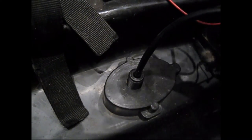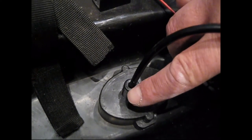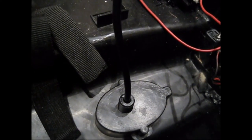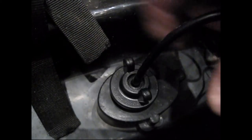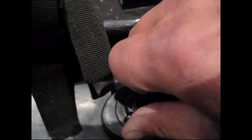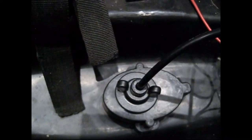There's a nut that we do up on the inside of the boat which tightens it right up and forms a waterproof seal. This is the inside of the boat — we can see the nut has come up through here, this is the thread, and you can see that it encases the transducer wiring. I'll just tighten the nut up now and secure the fish finder in place, getting it nice and tight and pulling the orange seal right up, giving us a totally waterproof installation.